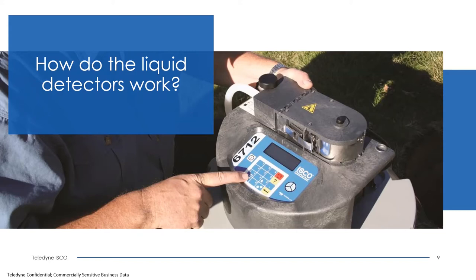Making sure your strainer is completely submerged and there are no leaks in the lines will fix that issue. To test the liquid detector, open the door above it, run the pump, and rub your finger on the detector to apply a little pressure when water reaches your finger area. That will help you determine if the liquid detector is giving you issues. Our tech service department can help you work through those problems as well.